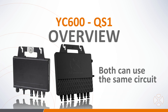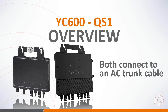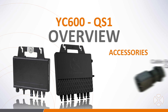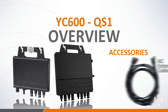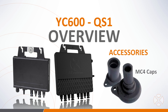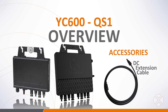YC600 and QS1 microinverters can be conveniently used together on the same circuit. We'll get into the details of how to best mix and match these microinverter models a bit later. Both microinverter units connect to an AC bus or trunk cable, which has accessories including a terminal cap to cap off a terminal that would normally connect to a microinverter, a cable end cap for sealing a cut trunk cable, and an AC extension cable to go around a chimney, for example, as well as male and female connectors to connect the extension cable to the trunk line.